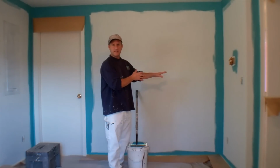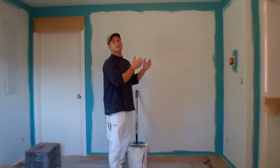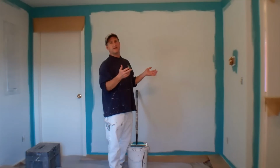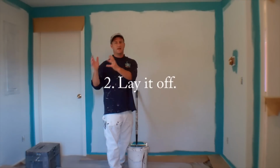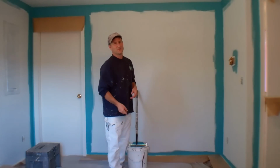Then you go back to the beginning and you do one final roller stroke on the whole wall to smooth it all out. I call that laying it off. All right? As long as you lay it on and lay it off, every time you paint a wall, it's going to look beautiful.